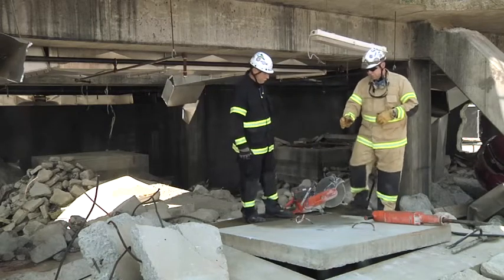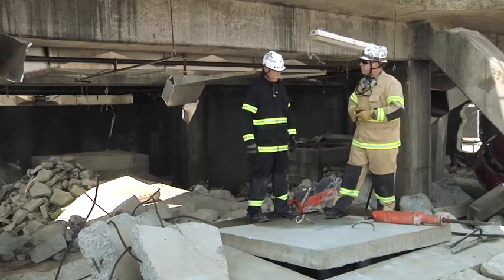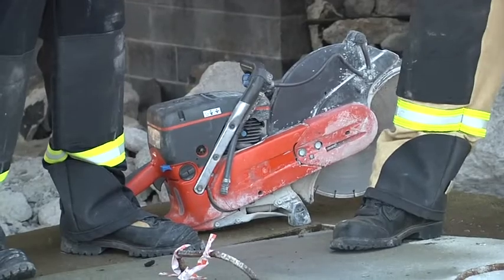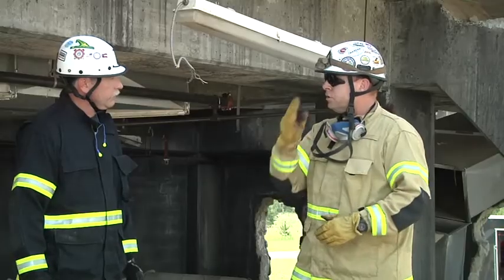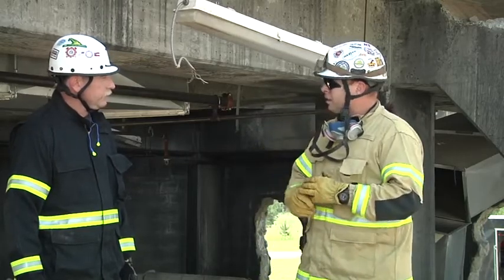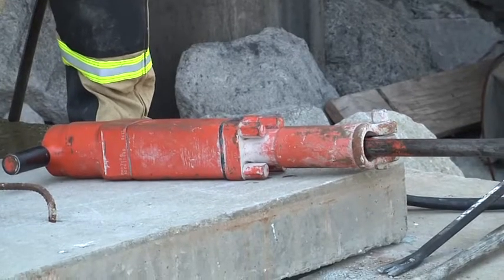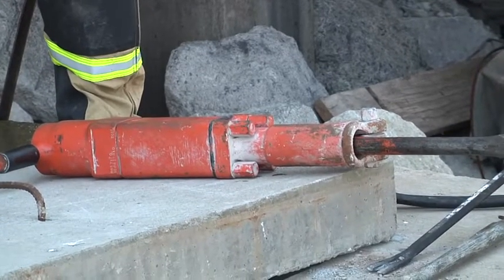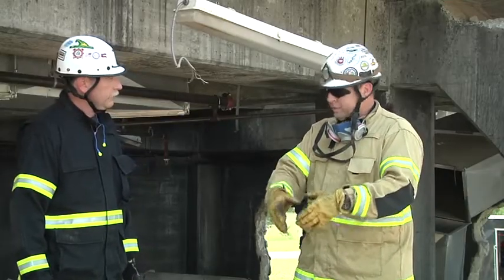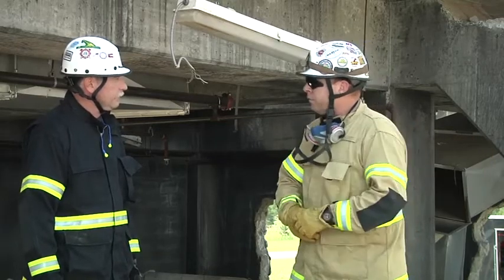Well, once we have our inspection hole bored and we've made the determination we're going to go with a dirty breach, we're going to take a rotary saw for cutting concrete, and we're going to make a relief cut across the inspection hole. So just a plunge, and an X across the inspection hole. What that does is relieves the concrete somewhat. Then we're going to take a jackhammer of some sort. We happen to have a Stanley hydraulic, a BR87 unit, and we're going to just start working from the inspection hole out throughout our X that we've relieved the concrete.